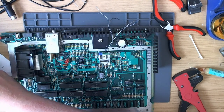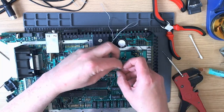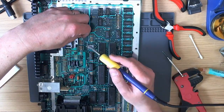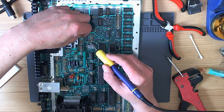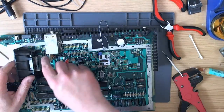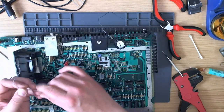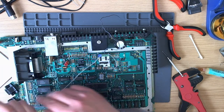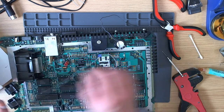Is that composite video? I don't even need composite video. Right, screw composite video for the moment. I don't care about composite video. I'm not even using a composite cable. Let's just test to see if this is going to work. So I said, does Chroma still need a series resistor? Well, it won't need a series resistor now on here, will it? No, it won't. So we've got luminance